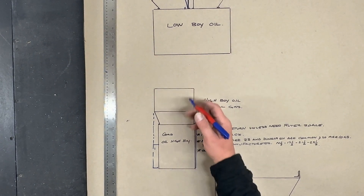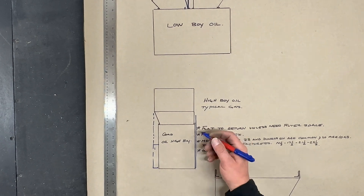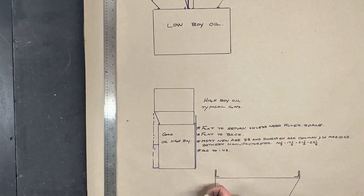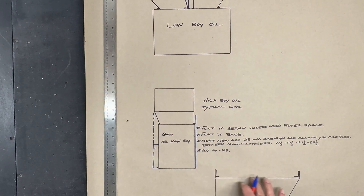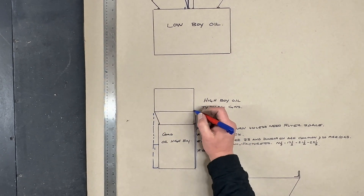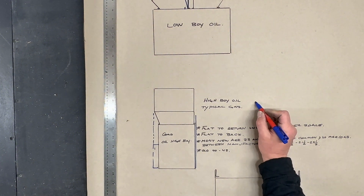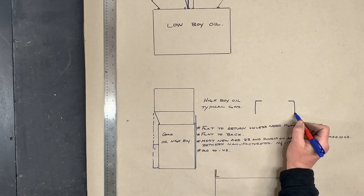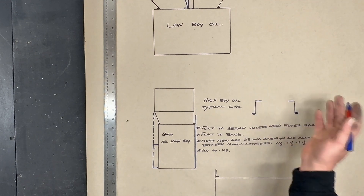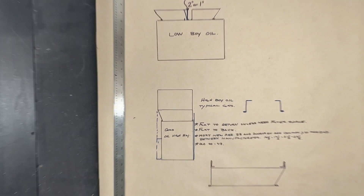What we're going to do today is make this fitting. I have a case coil that's fairly new and an older gas furnace, and my new one is 33 inches, so we're going to make a transition to go between the case coil and the furnace. We're going to make a cradle to hold that coil. A lot of times I see people come in and just make a transition come in an inch — that's all they do and then they tape it on there. This is a much better way and I'll show you how to do it.